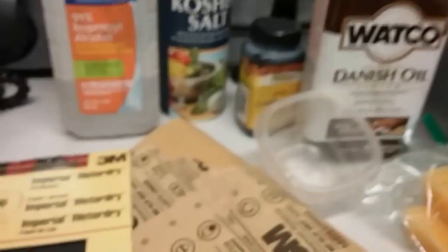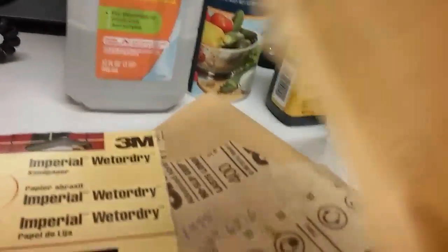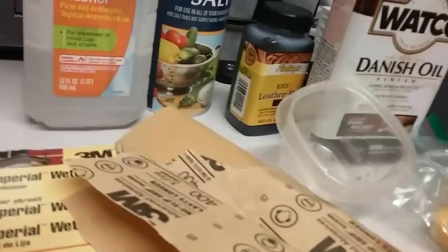What you need on your stems and your bowls — what I use: I only use 400 and 800 grit sandpaper. I start out with the 400, sand that bowl or that stem down, and I wet sand it. I always wet sand it — keep my papers wet. Then I buff it out with a rag; it's an old t-shirt. When I'm done with this one I'll get another old t-shirt and do it again.